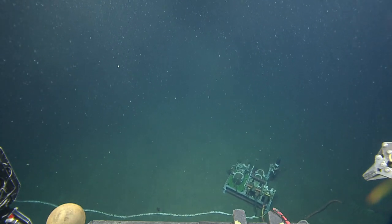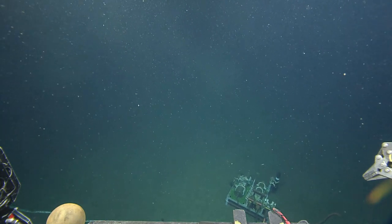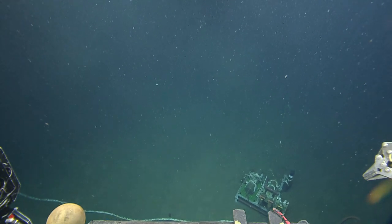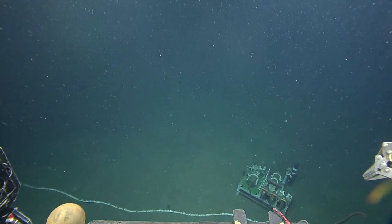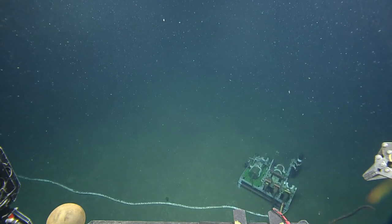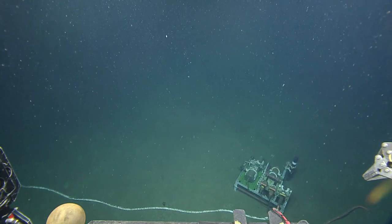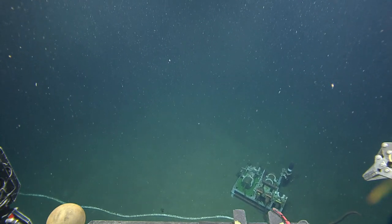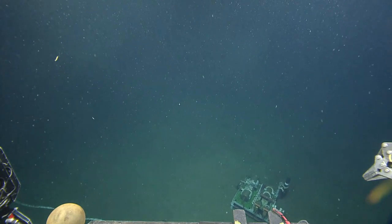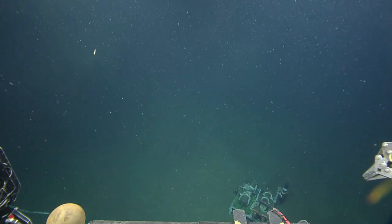Okay. And that tether, Dirk, the standard length for the cable between the auxiliary platform and the broadband seismometer is 20 meters. Okay, so it's within 20 meters like this, probably around 11 or 12 or somewhere in that range. Yeah, there's a bit of curve on it, right? I think this cable heading off this direction back to the mud mat is like a 70 meter cable. So we're probably very safe if we drop it here-ish, just free of the white cable. Yeah, either there or south of the works, closer to the bead bags.